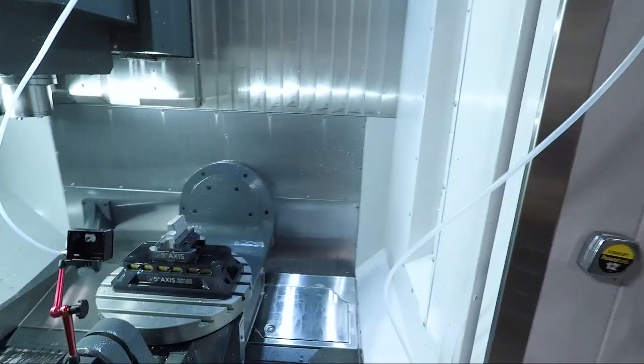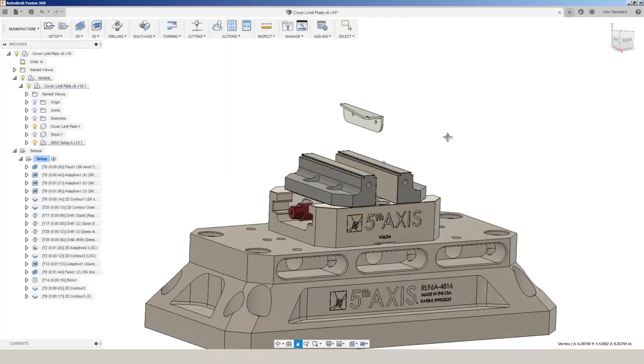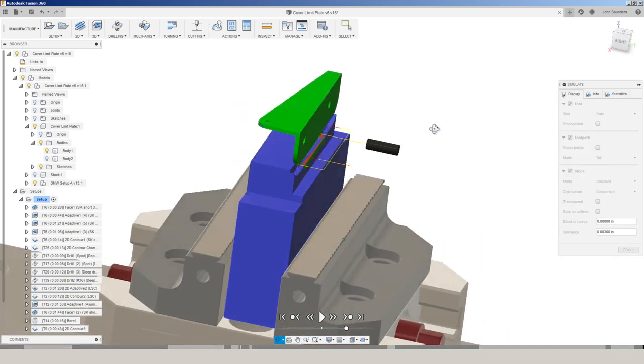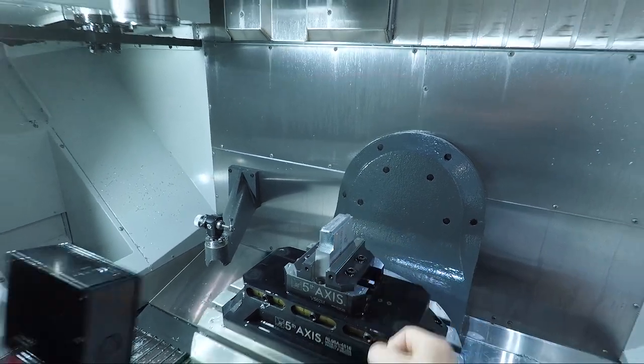You do so much more in the CAM, and it really requires a lot of critical thinking. On a traditional three-axis part, it's usually a pretty normal progressive workflow of a combination of roughing strategies, finishing strategies, and drilling. On the five axis, you're really mixing that up. Like this part right here is going to turn out to be kind of an L-shaped bracket and it'll be really thin along this wall. So I'm mixing my points of where I'm roughing out, doing a little strategy here to open up to do a finishing strategy, drilling and tapping over here before I remove the rest of it.